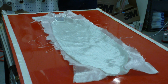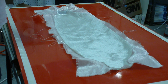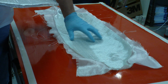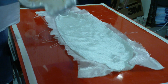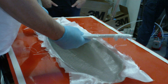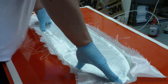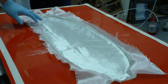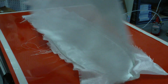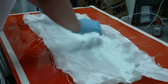The core is 3/8-inch balsa, scrimmed and scored. The back is backed with a thin fiberglass, but I've also already put my top layer of this triax and glued it on here so that it'll fit in better. That way I can lay it right inside of here, and it's like wrapping the rails around it — makes the whole thing fit together well. And then this is going to be my top cloth — goes over, smooth out the wrinkles, make it all pretty.